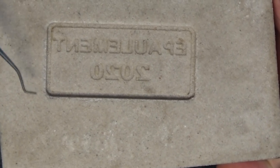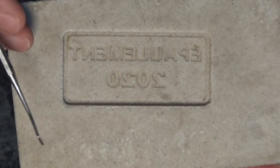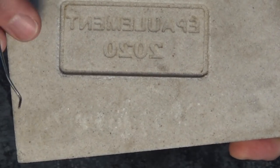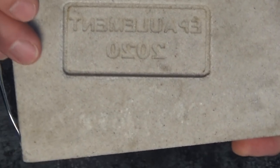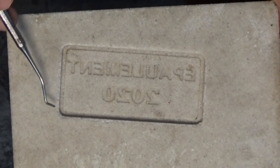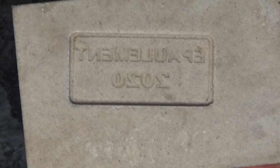I guess the next thing is, are we going to create some sort of a toxic fume fire? I don't know. When I've done this in the past making cores, the metal has formed correctly. The resin and the sand eventually deteriorate and break down, but it seems to hold together long enough for the metal to form correctly before it freezes. So yeah, let's keep going.